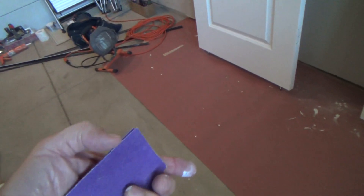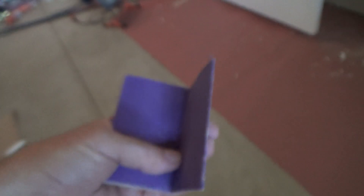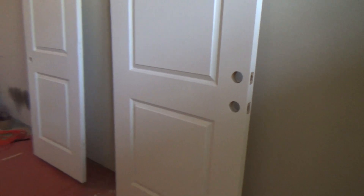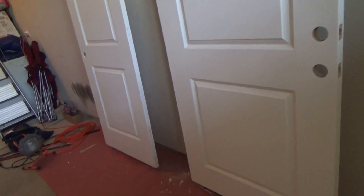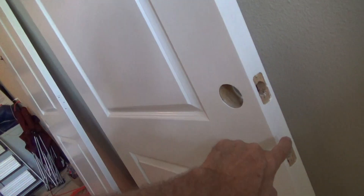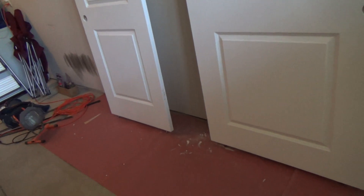I just took a big piece of sandpaper, folded it back and forth — now you've got four edges you can sand with. I won't sand it very hard. I don't want to go through the dried surface paint into the back side, because that back side could take a day or two to cure. Your paint bucket might say it needs 48 hours to cure, but the top surface will still be dry. I'll lightly sand, wipe it off, and do the whole thing again just like I showed you. The edges look fine — I don't think I need to add more paint there.